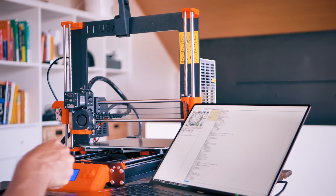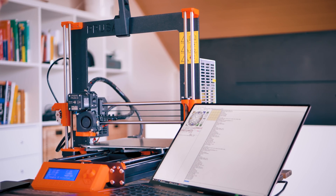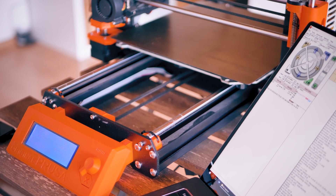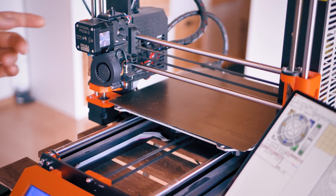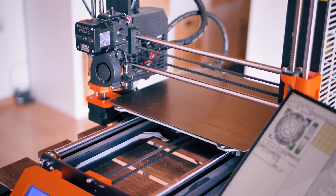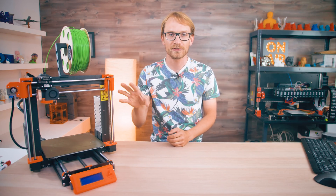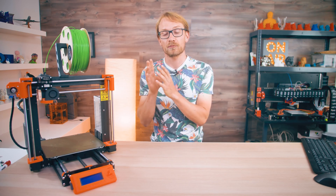Just to show what that was supposed to look like, here's the fixed G-code again: first it goes fast, and then it slows down because now the new settings are loaded, and these are permanently stored. That's interesting — home just stopped working, because I guess it's going at the wrong speed. This could be even better than I thought. So that worked better than expected; it took a few iterations, but it does work. Turns out, you can actually save printer settings permanently with G-code printed from an SD card, and yeah, this printer is a bit slow now.